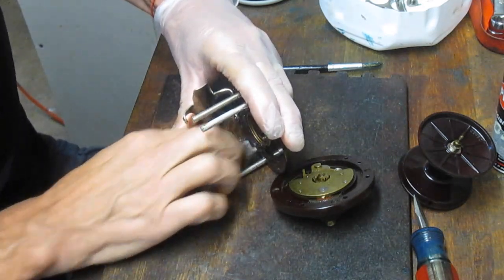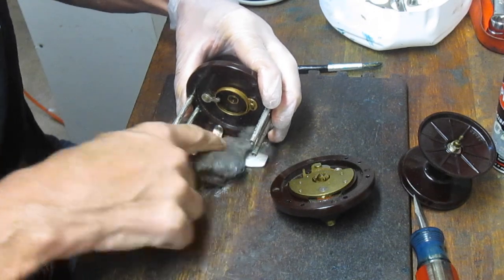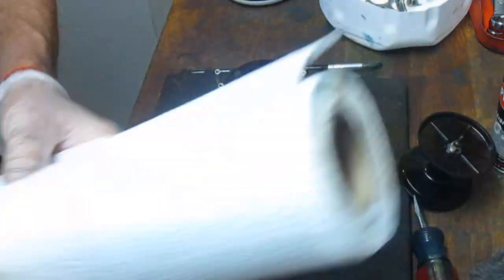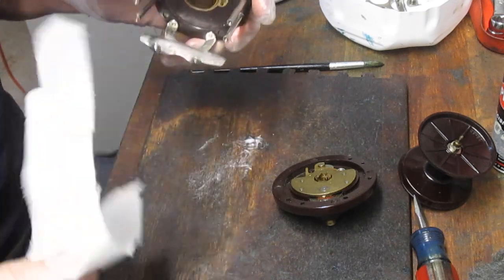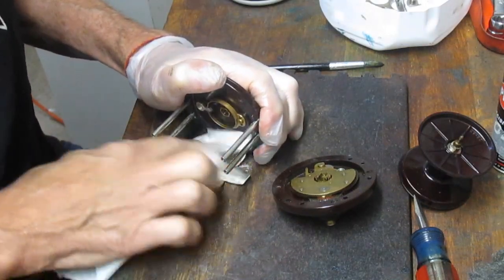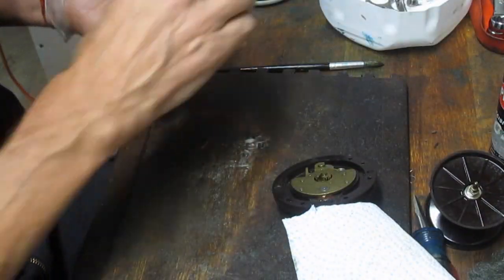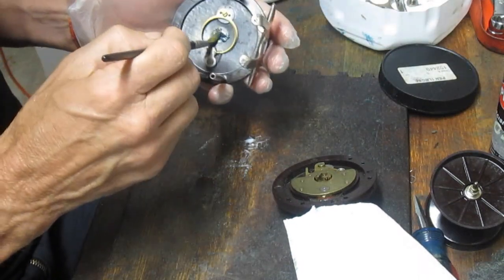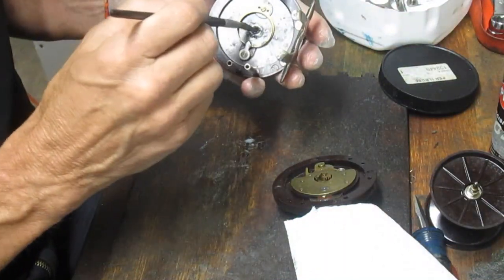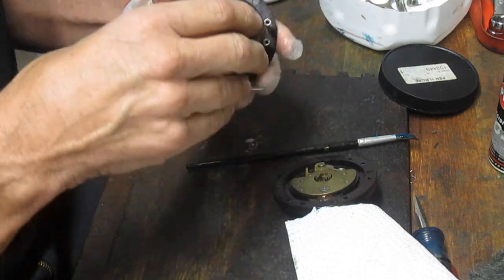Not a problem — if you were doing a thorough cleaning, you would remove the posts completely. It looks like we did get some polishing going on here. Again, there's crackling on the bottom showing this had some salt sitting on it for a while, so I'll just take a paper towel and clean that up as best I can. This isn't a full restoration — it's just let's make sure it all works and that it got a fair deal. I'm going to put some grease into the adjuster and the bushing, and make sure we tighten it down.